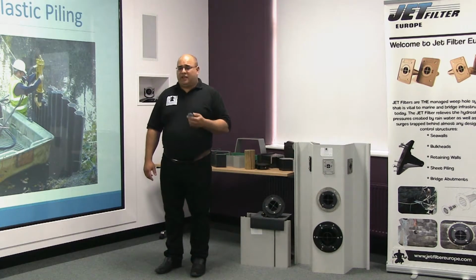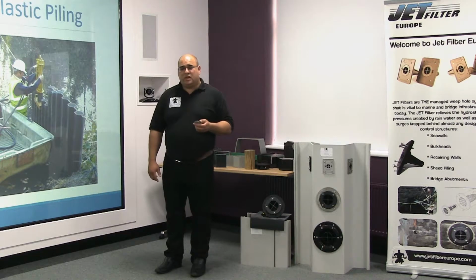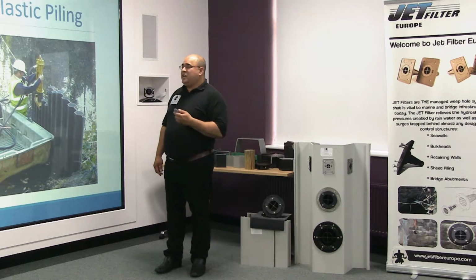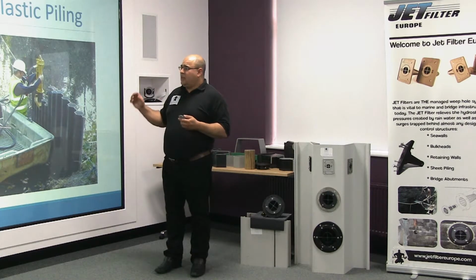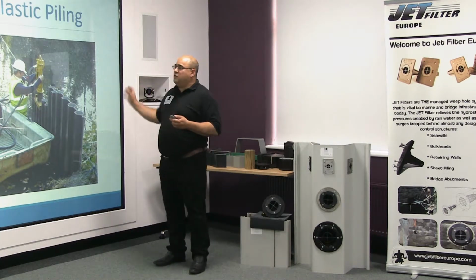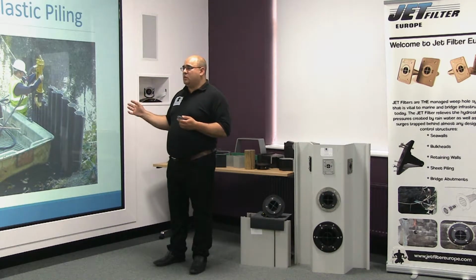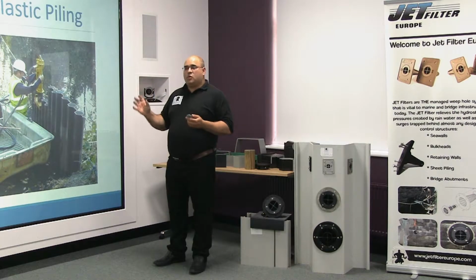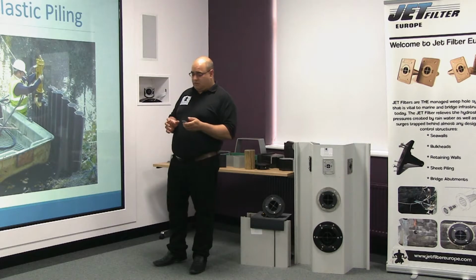We always advocate, whether you're driving steel, timber or plastic, to use the largest hammer that you're capable of using, simply because most of these jobs do not know what kind of soil they're going into. And when driving any kind of pile into the ground, it is very important to ensure that you have sufficient force to overcome the ground resistance. And obviously handheld hammers and mauls are very, very small, hence portable and get into tight sites, but they don't have the most power. In soft driving conditions though, they're perfect.